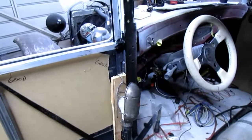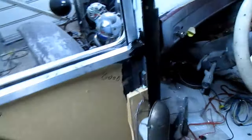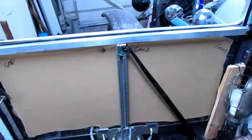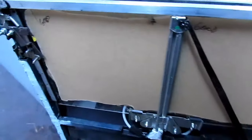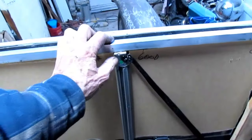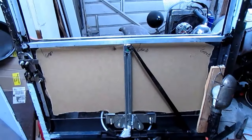Here's the results of that. I glued this stuff into here — the channels. The window worked good, it went up and down. I just cut a three-quarter-inch square bar here — it's just like a sixteenth or eighth of an inch lower than the door frame, so that's good. I've got another 45-degree brace — I haven't welded it in here yet. I've still got a little movement in this. I don't really want to fix it yet until I get it to go up and down and see how everything's going to work.